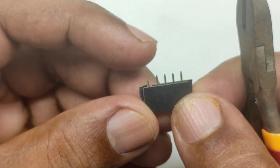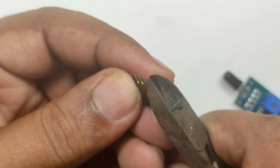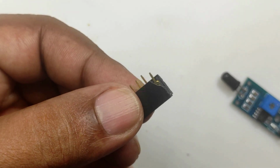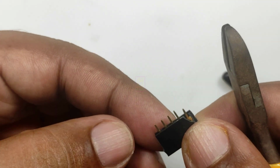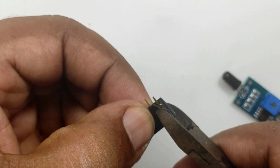Normally, the sensor or flame detector LED will be detached from the module and fixed in the flame detection area, and will be connected using a long wire to the sensor circuit. The detection angle of the sensor LED is only 60 degrees. So we will be using multiple sensor LEDs connected to the same sensor circuit for covering more area.